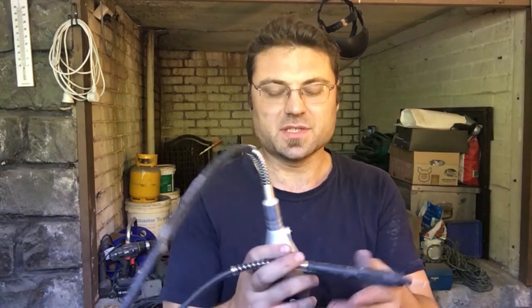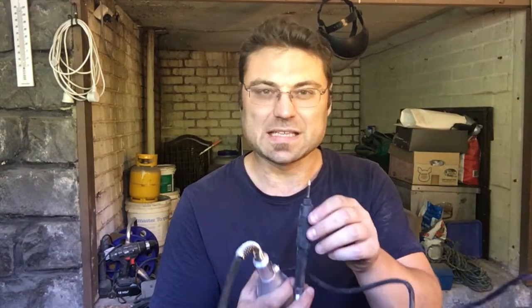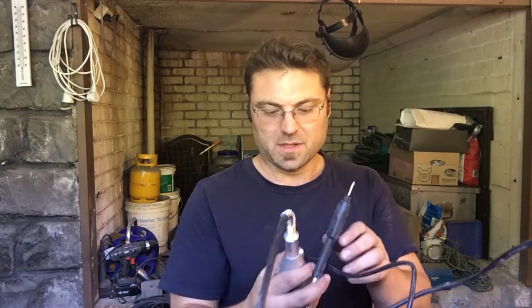This section seems to be a bit hard — with the centre of the R for instance, I've engraved around it to give it some depth, but for the centre part, rather than just take my time and whittle it all back, I'm going to use this rotary tool — it's a Dremel-like thing. The only problem is it is a cheap one, which means the tools themselves are not very fine. It should be okay for this because I've already engraved around the area where I want to go in — it's not quite a mil deep but around about that. This should be able to get a little bit of depth in the centre, so let's give it a go.